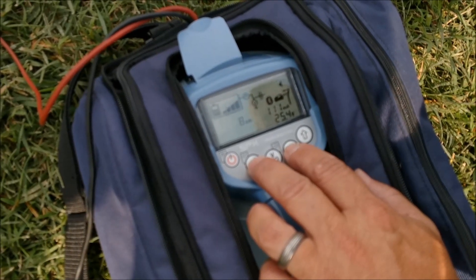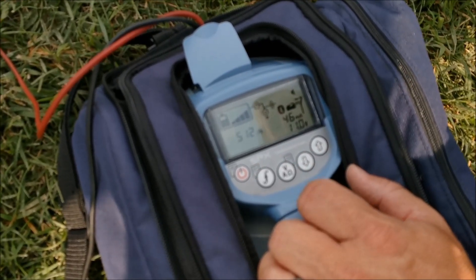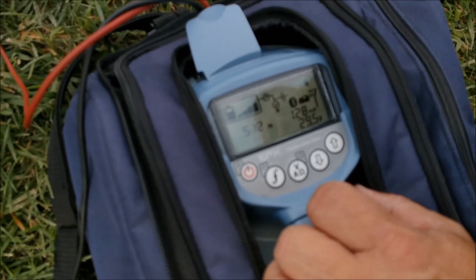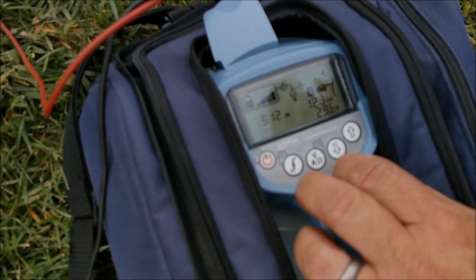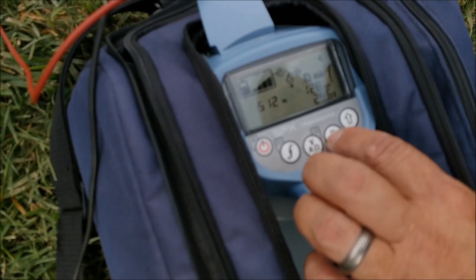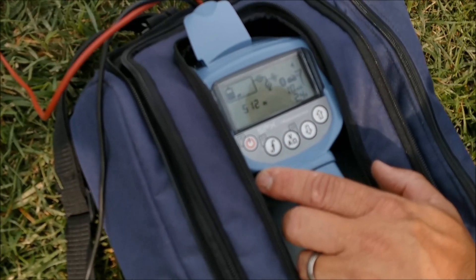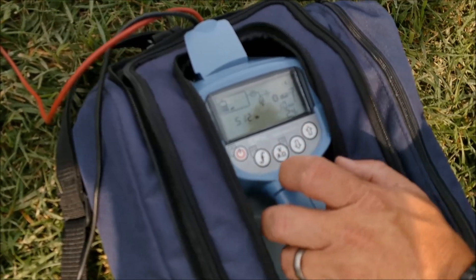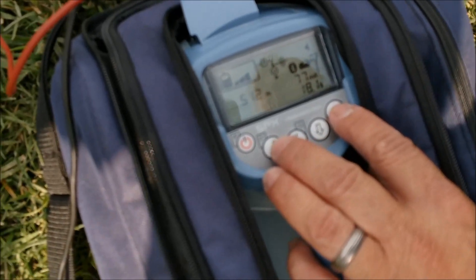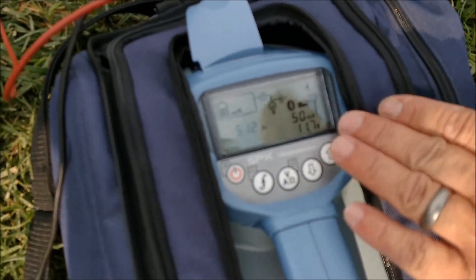We had 132 milliamps on 8 kilohertz — I'll go down to 512 by pushing the F key. We have 128 milliamps on 512, because 512 is having a little harder time traveling down this wire. More than likely the other end of the wire is not grounded. If you're staying close in proximity to the transmitter on your locate, you only need one bar of output. For more than one yard, or into the neighbor's yard, you'd probably want two bars. For a whole city block, three bars will do that. For beyond that, go up to four. By staying lower in your power level, you're not going to bleed off as much and you'll conserve battery life.